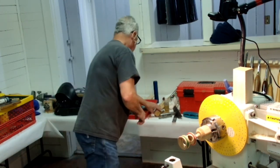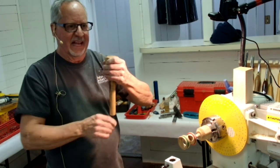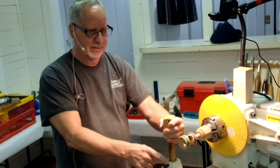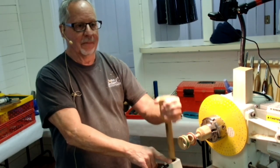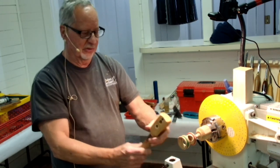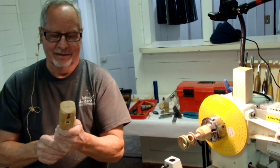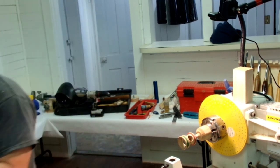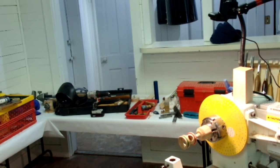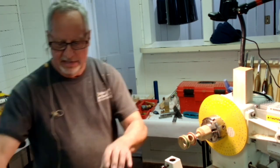Like I say, I prefer to use a hardwood if I can. I've got some made out of pine for one-time usage. What I do is I turn this to match my banjo, low enough that this will actually center or go up above the piece, one or the other. And then I simply drill holes, and you'll see they're labeled 9/32, 3/8, 1/2 inch, 5/8, quarter inch, 5/16, whatever. I just custom make them when I need them for whatever drill bit I need.